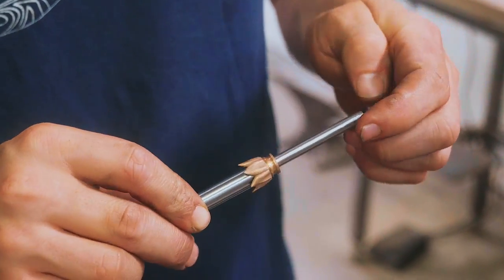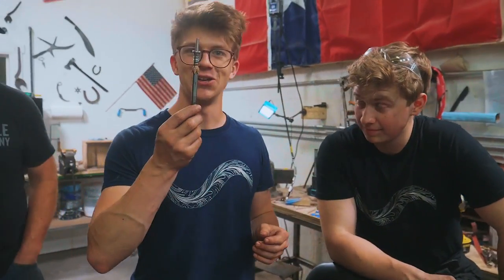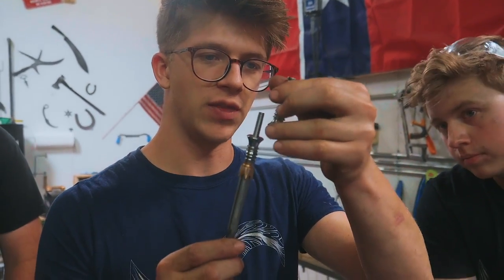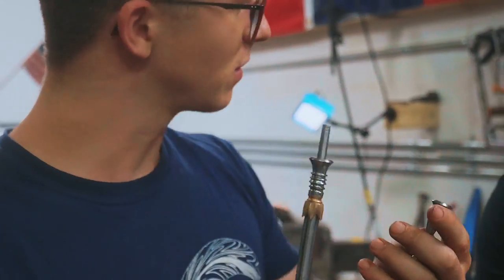Have a look at that. We have ourselves some fittings that fit. And holy moly, does that look amazing. Finally. This is gorgeous. This needs to get threaded. We also have to put a 6mm thread on the inside of this, because that is drilled to 5mm. And this is going to be something special. So, might as well cut those threads now.